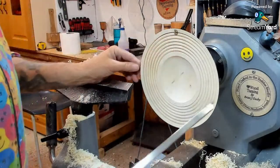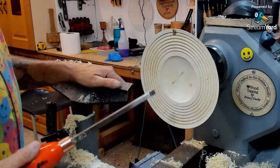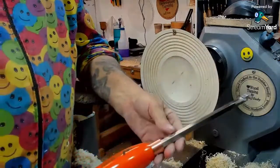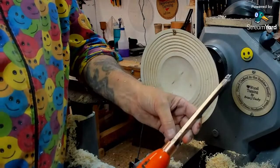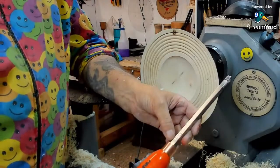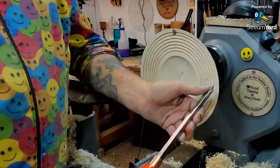But that's an immense little tool, I have to say. 30-something pound for that little cutter. Paul says he's discovered today that the cutter fits on the smaller handle as well. I think the smallest handle is only 60 pound. This is a CI2 hollower. It'll fit on any CI2. CI is carbide insert. That's what the CI means, carbide insert. And 2 is the size of the bar and whatever fittings on here. So if it's a CI2 tool, it should fit on it.